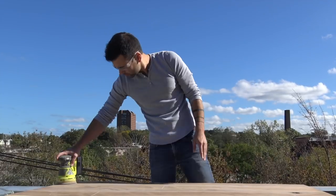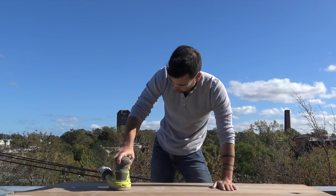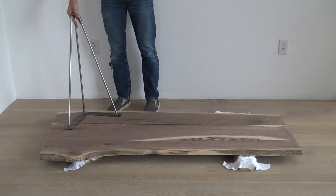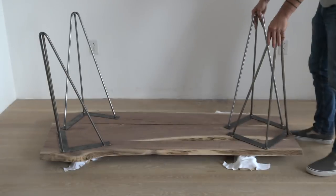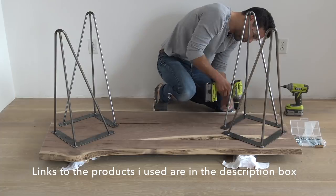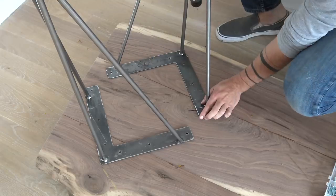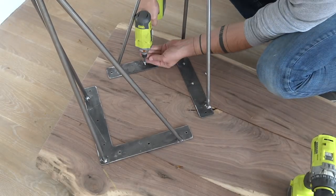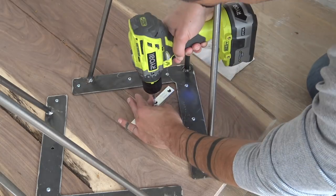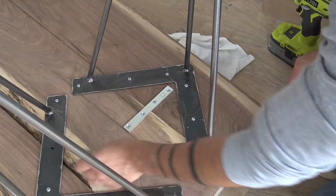Once I had the shape that I wanted and had removed all the major scratches and marks, I then did a finished sanding with 220 grit pads. I'm going to use these heavy duty hairpin legs as the base for the table. What I like about these particular legs is that they have really wide brackets which is actually going to serve to reinforce the tabletop from the underside. I don't want the wood to split so I pre-drilled holes before driving in the screws — you have to be very careful not to pre-drill all the way through the tabletop. If you don't have a biscuit joiner or you just want to super reinforce the tabletop, you can add metal mending plates on the underside as well.